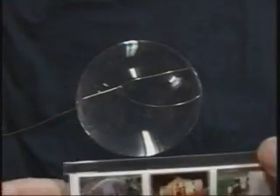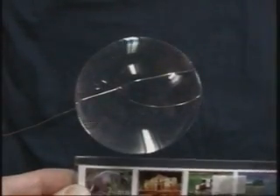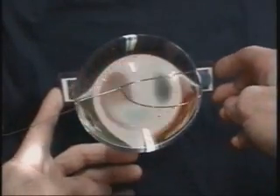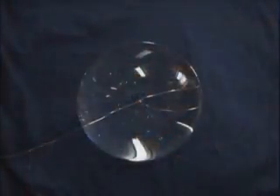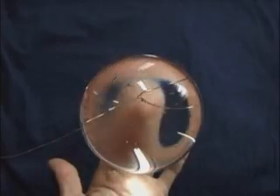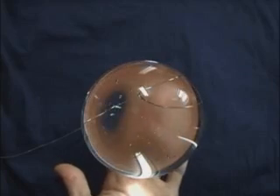I held up a little ruler so we can get a length scale — it's about 90 millimeters in diameter now. There you can see that the sphere makes sort of an aberrated lens when you hold the ruler up behind it. It makes this big, ugly finger when you put it at the right focal point behind it. A spherical lens — a complete sphere like this — is not known to be the best optic for a magnifying lens. Here you see the sphere made to final size, and you can see it's about the size of my head.